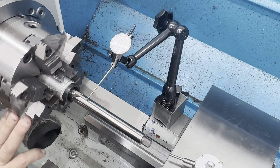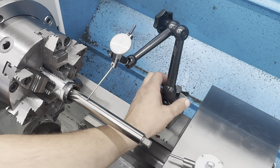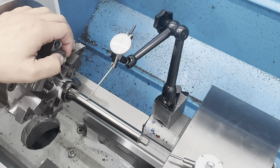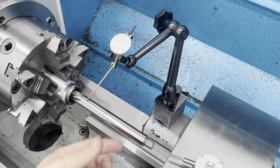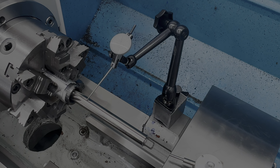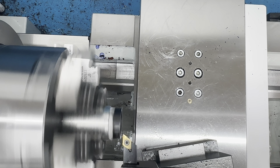That aluminum collar and the paper slide over and we hold it in the machine without scratching. All right, we got everything dialed in here — no movement. You can see if I adjust this it's definitely touching; we can go in and out. We got less than a tenth thou runout across the whole thing. Now all we got to do is take this mandrel out and make the cut, and then the receiver face is trued up to the bore.